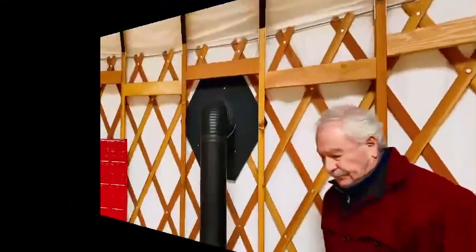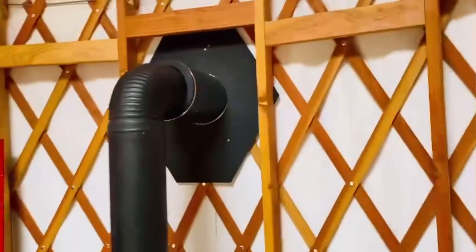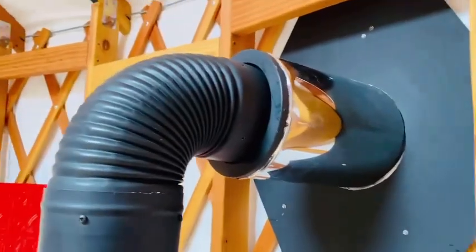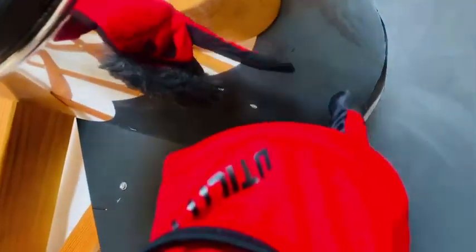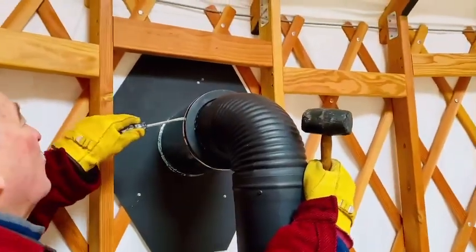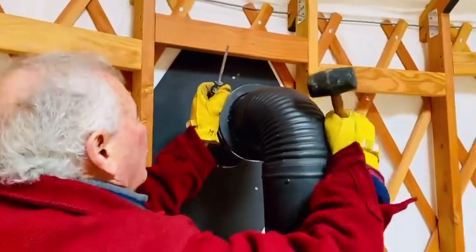We have to remove that plastic. It has a plastic seal on it. All right, we should have removed this plastic before, if you guys are doing this on your own. So we had to move the stove twice to be able to line it up, line the piping with the extension that goes out. It goes in just fine, and then in here, we're gonna seal this with some fireproof sealant for insulation. We're almost there.